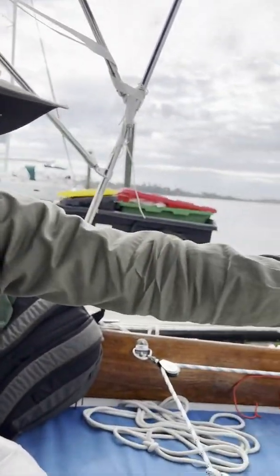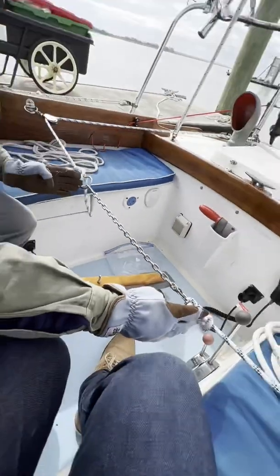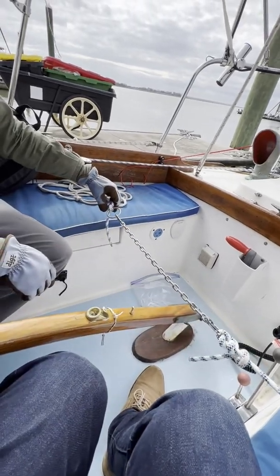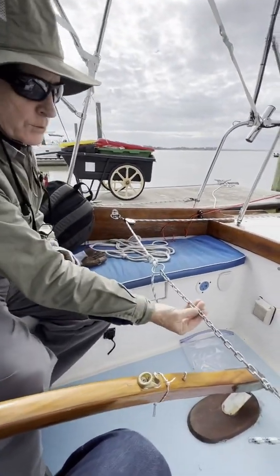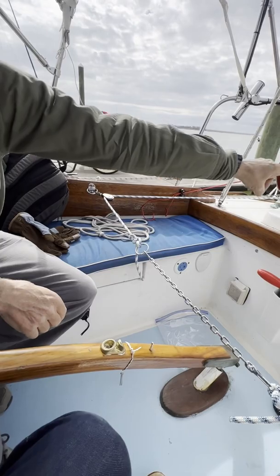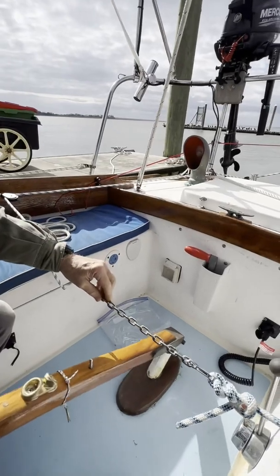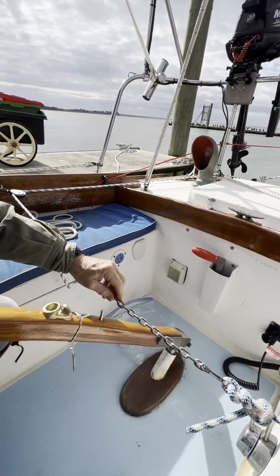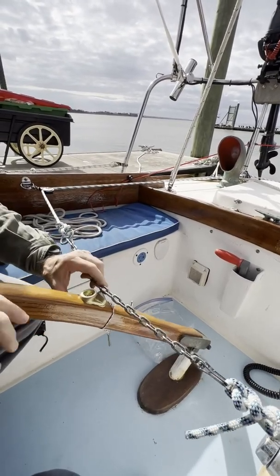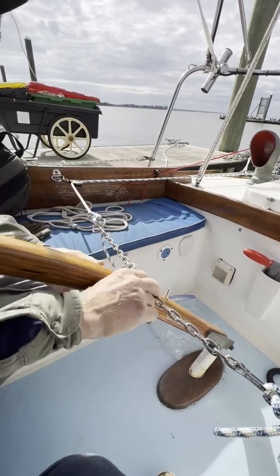You see it right now? It's straight up and down. You want this chain to be in the center of the cockpit, and you can adjust the chain by loosening a knot and tightening the opposite side. This little blue tape mark marks the center position of the chain. So if that rudder is straight up and down, this center of the chain mark should be in the center of the cockpit, or in line with the tiller when the tiller is straight. Then you can set this in and pin it, because it doesn't like to stay in by itself.